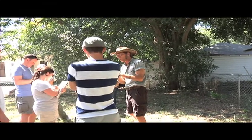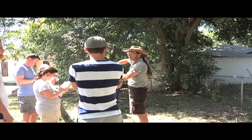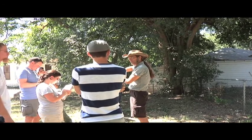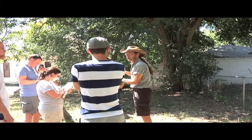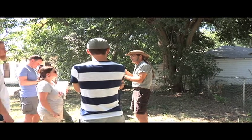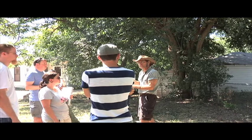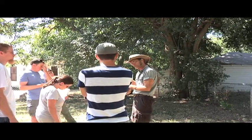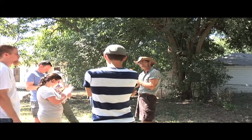You get a 30-year warranty underneath your metal roof, so if your metal roof leaks — not for any other reason than just over time — you ended up with an oval. Over 15 years the neoprene cracks and water gets in around the neoprene into this oval, or it pulls loose because you didn't catch the 1x4 underneath the shingle. You have to use a good 2-inch screw. All these things come into play if you're going to do metal over.